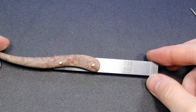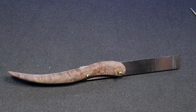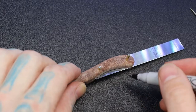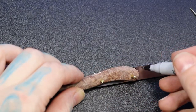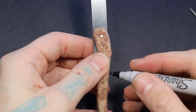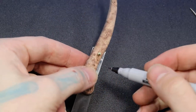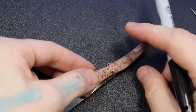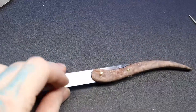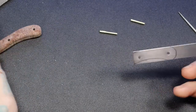Now you can see why you want to wait to draw the design on — now that the pins are there, we know the metal will be in this fixed position and it won't move. So we want to trace the metal with our marker. This is also why we didn't sand it down through all the different grits yet — because some marker might get on the wood and we'll have to sand that off. I'm doing all sides just in case; it's worth it because when you're grinding with the bench grinder you're dipping it in water a lot.